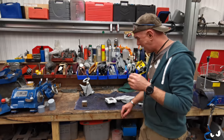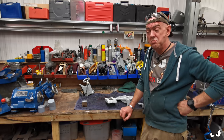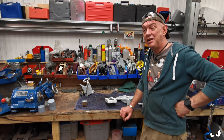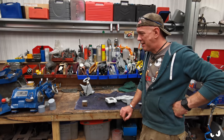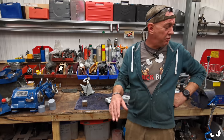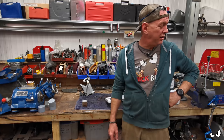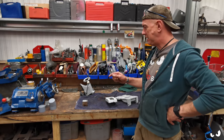But is it absolutely dead nuts on? No, it ain't. Is it going to be? No, it ain't. Ask a Navy engineer if the lathe on his battleship works quite happily, and he'll tell you yes. It doesn't have to be. As long as everything from the ways upwards is, the rest of it is just kind of good practice. So it's level-ish, but that's going to do.